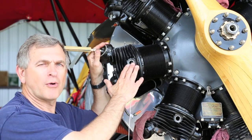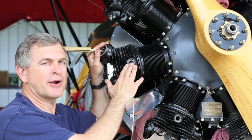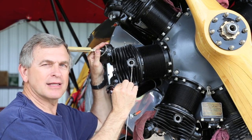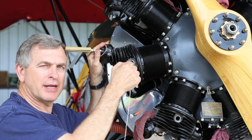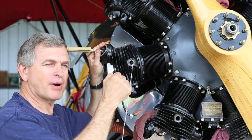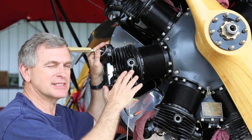Well, we have all of the rope now in the cylinder. We have about 30 feet of quarter inch nylon rope in there. The nice thin rope will give us good packing in there. So I then raise the piston, pull it around with the prop, and pack that rope up tight against the valve to keep it tight against the seat.